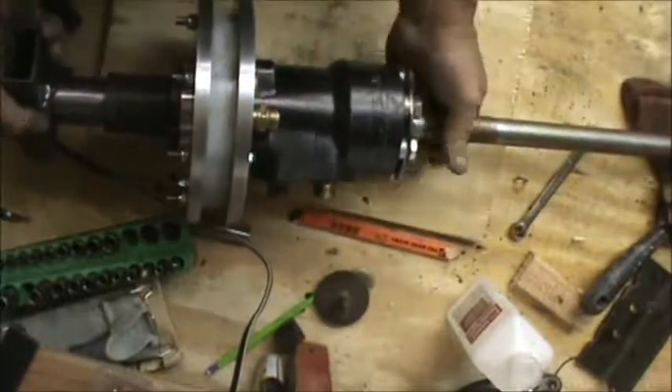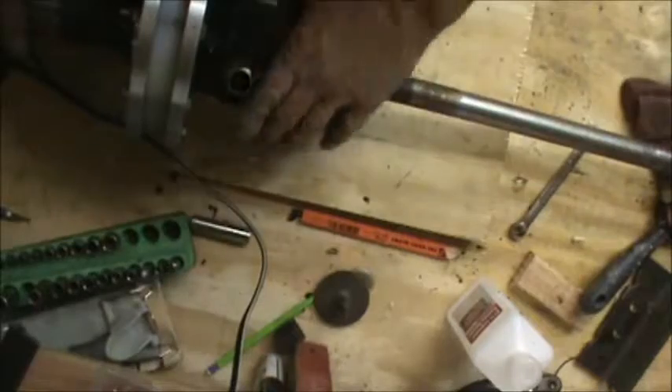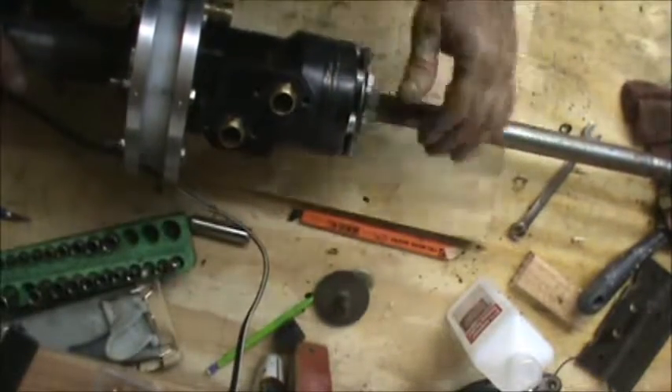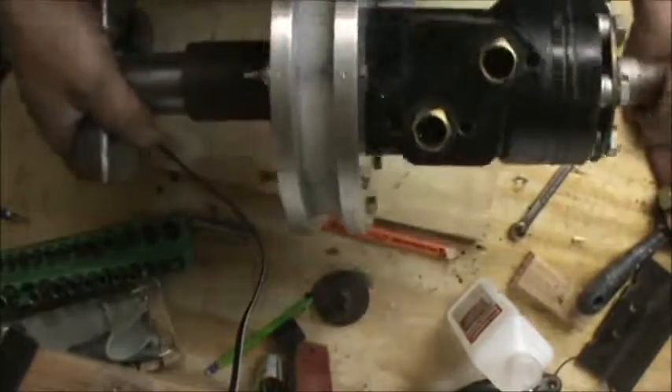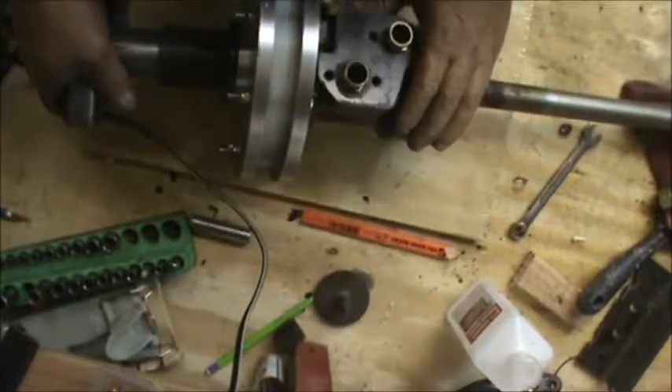What I ended up doing — I spun it up a little bit and figured, since you've seen how it basically comes together, now this is the main shaft of the pump itself. So the hydrostatic motor is actually part of the main output shaft. The key is that this base is actually locked down, so when you spin this, the motor actually spins — instead of the shaft, the housing actually spins.